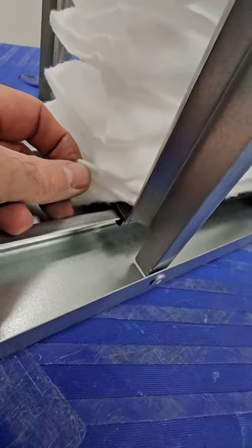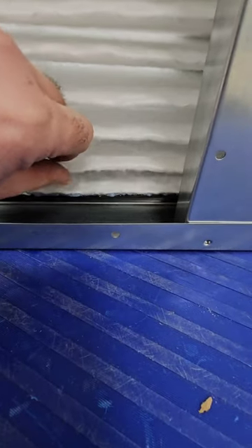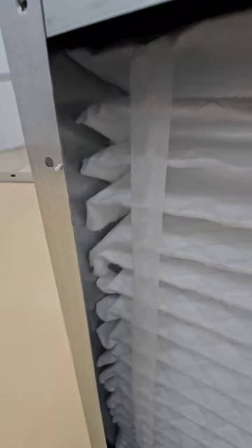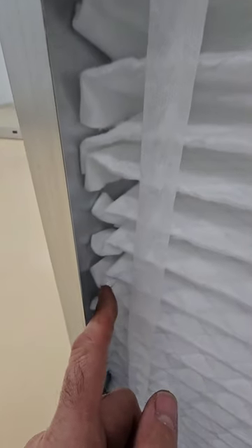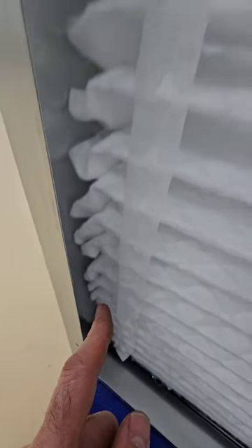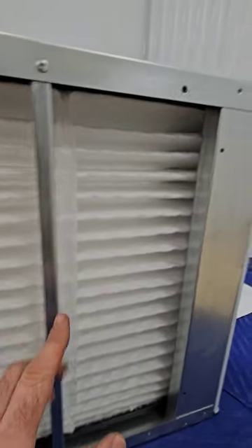We're in the track at the bottom and also in the track at the top. You can see how we're going to prevent any bypass of air or debris because we are right within that track, and the media comes right down to the bottom with no way to go around it. With the filter fully in, the ends are butted up against the cabinet to prevent bypass there as well. And as we put the door on, it butts up against these end pieces, so what we're left with is a four-inch media pleat that has minimal bypass around it.